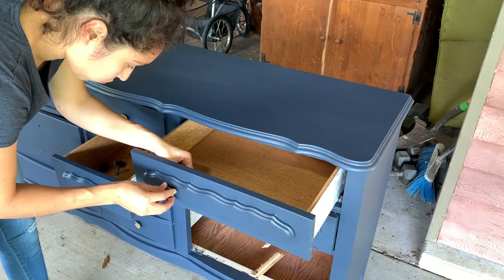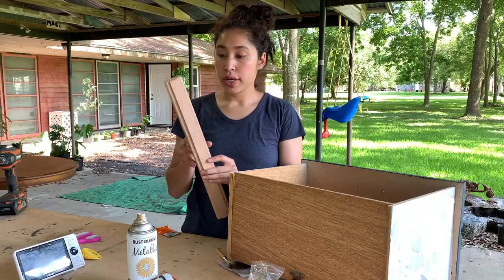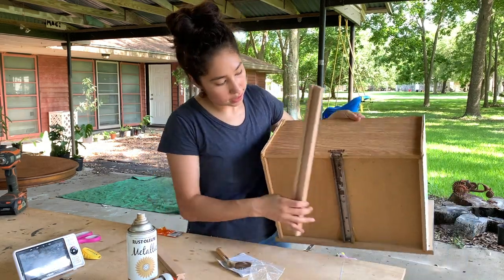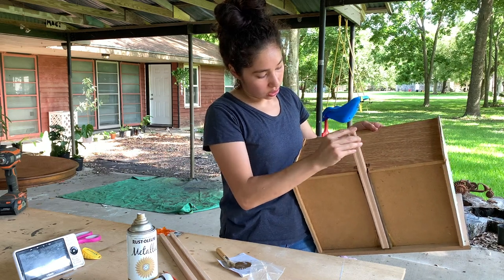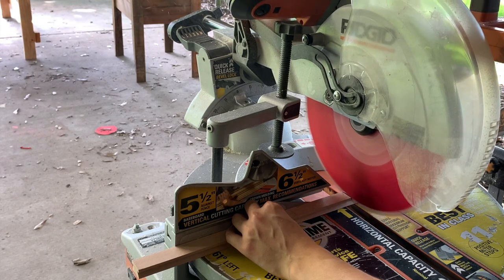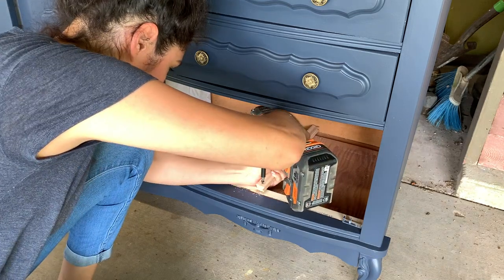For the drawers that needed longer screws to put the hardware in, I added a nut to make it fit. I also ordered a new track for the one drawer that had a broken track. I'm not going to be able to use the guide that goes on the back because the new one is way thicker than the original, but it fits in perfectly fine. I just need to cut it to size and trim it down, then drill a pilot hole before securing it with a screw.